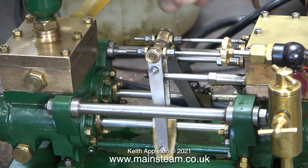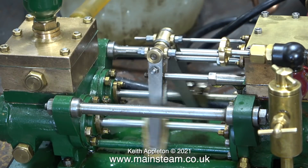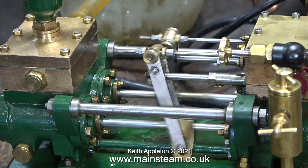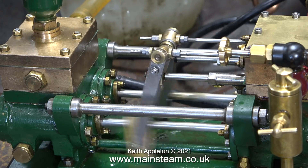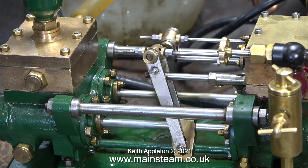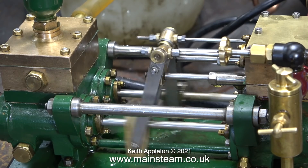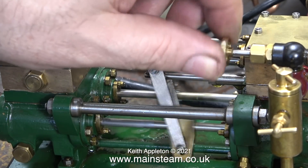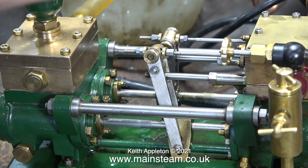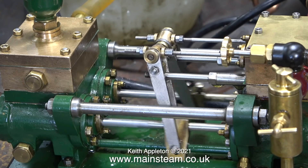This tweaking session was quite successful — the beats are sounding slightly more even. It will be better though when I put some back pressure in the system so the pump is having to push a bit harder. It's rattling because the pistons are hitting each end of the cylinder at slow speed since it's not really pumping. It's not as even as I'd like it to be.